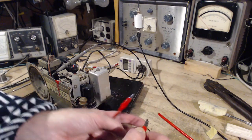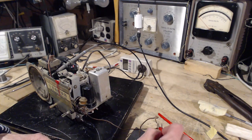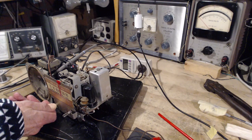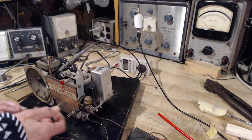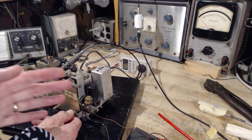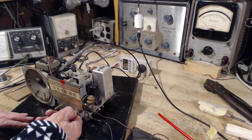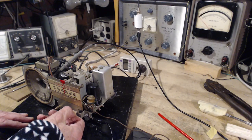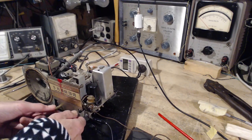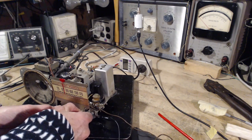Take that off. Antenna. Ooh, that didn't make any difference whatsoever on the radio. So it's picking up signals that are being converted to 455, and they're going through the IF, and they're coming out with an oscillation. So at this point, there is an oscillation in the radio, heterodyning with the one generated by the incoming signal.